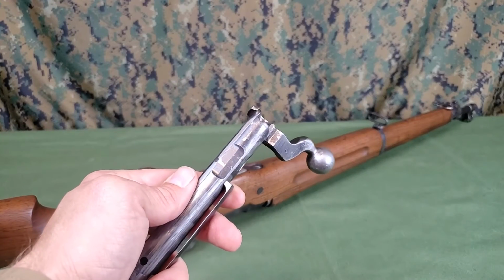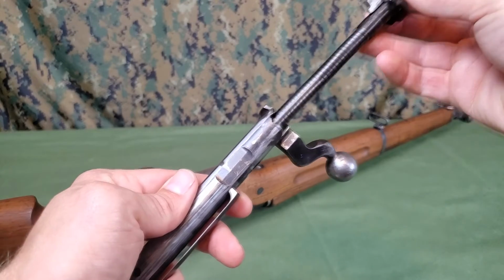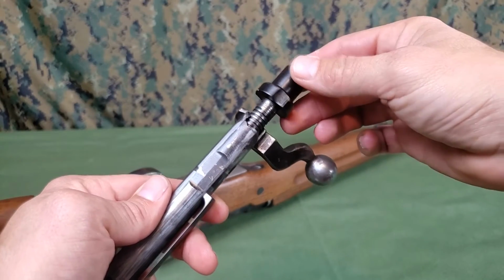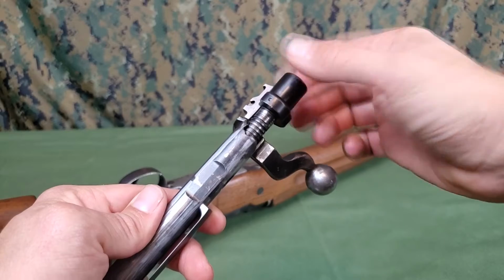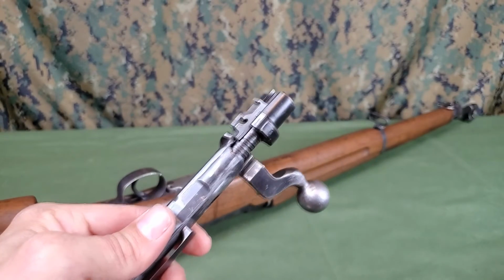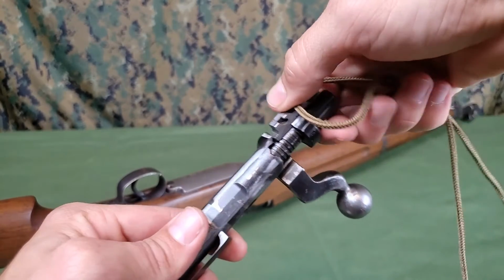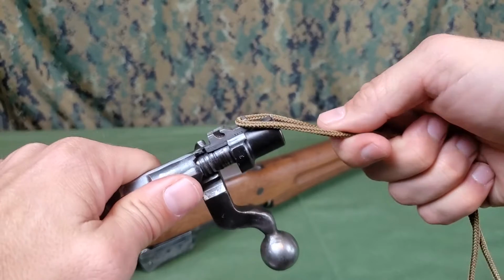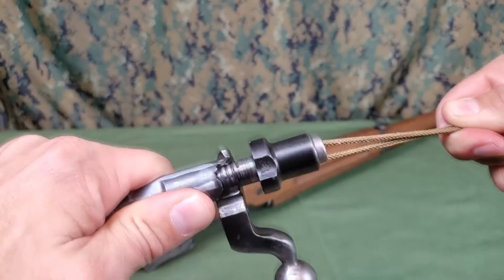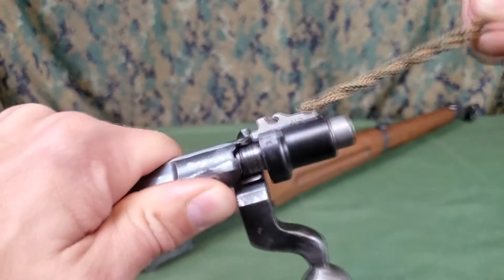Grasp the bolt in the left hand and start the threads on the barrel of the sleeve into the threads in the end of the bolt. Hook the loop of the string on the dismounting hook and, holding the ends of the string in the right hand, pull the cocking piece out and screw the sleeve home in the bolt body by turning it clockwise.